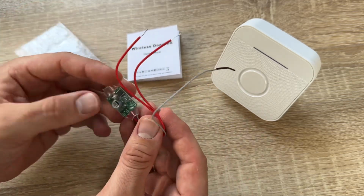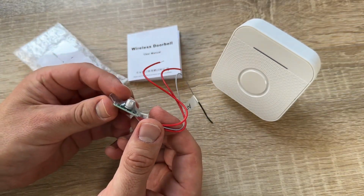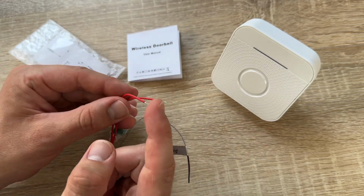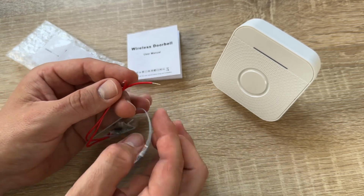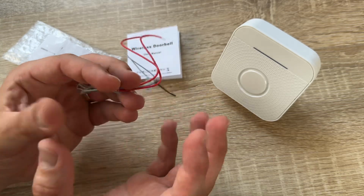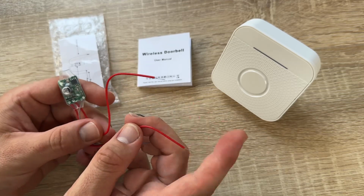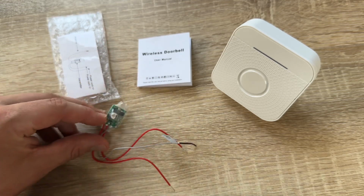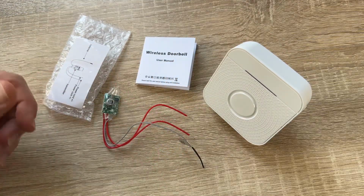The transmitter button, we can see if the button on the Gong is pushed, it will show an LED indicator and of course the sound. To reset it, we press the down button for 5 seconds to reset the receiver to the default settings. When the receiver sounds the ding dong with the LED flashing, that means that the reset was successful. Then we can follow the installation instructions again, and we can pair it with another Bitiwend radio signal forwarding wireless extension set.